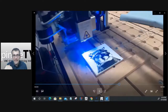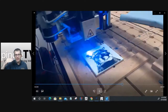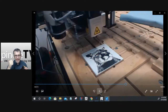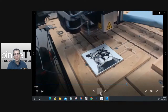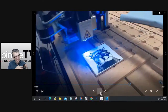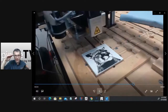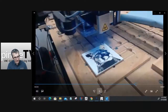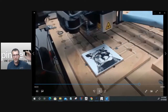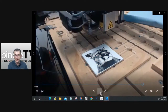Because as that shading, that grayscale, the voltage or the power is going to go from 85% down to zero. It's going to cycle between those two. And in the dark black areas of that image, that's going to be the highest power. And the grayer shades, the lighter blacks, that's when that power is going to reduce. And I said 85% to zero. I meant zero to 10% when we're talking about the Hulk. But we're going to talk about that in just a second.